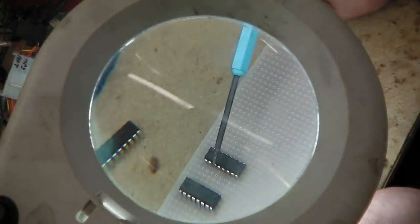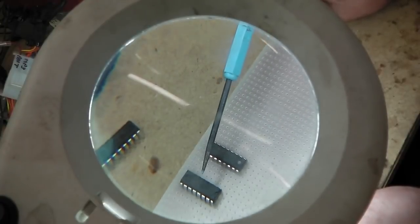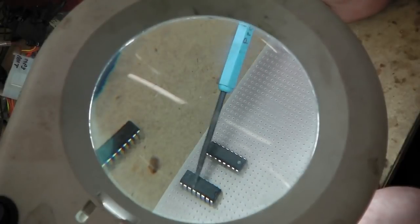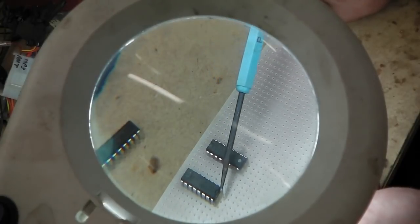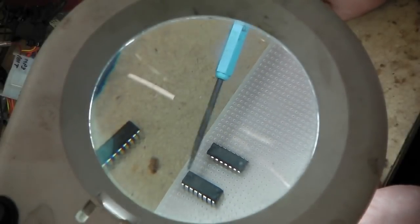The other one's a transistor bank. Banks of little tiny transistors used for switching the relays. That's just a simple relay switching chip, all in one. Instead of me having to solder 10 or however many transistors I'd use, I might only be using 3 or 4, depending on what I'm switching.